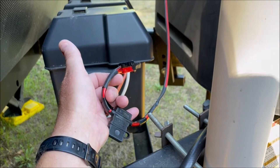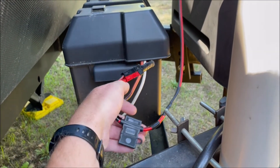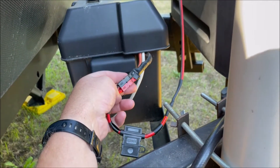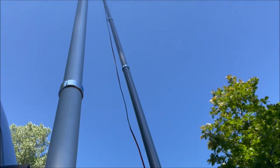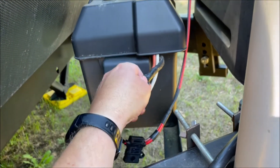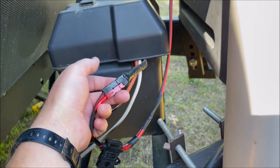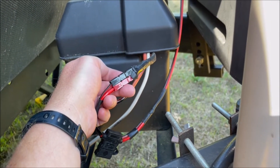We're just behind the propane tanks in front of my rig here, and this is the battery box. There's a 3-amp fuse in this fuse holder, and these are Anderson power poles that I use as a connector for the 12 volts that runs up the pole and connects to our repeater up top. To connect and disconnect, it's very easy — you can just pull the terminals. They lock together and just snap in place quickly and easily.